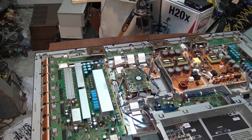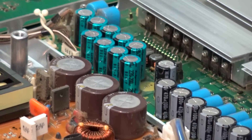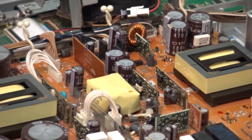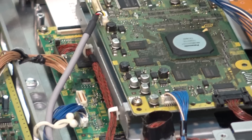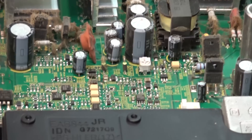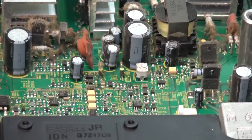I'm sure the loose ground screws caused an early death to a lot of these TVs. This is a very high quality television — look at the quality of the parts: all Nichicon caps, no bulging tops on any of these. This is first rate. This is probably one of the best television sets ever made — these Panasonic plasmas were just fantastic TVs. Have you ever seen manufacturing like this? The quality of construction on the boards is just impeccable. But the weak link on these televisions was the bloody ground screws — that was the weak link.